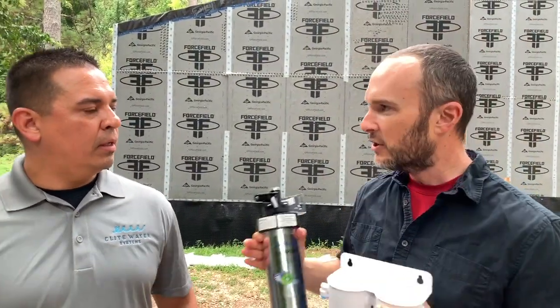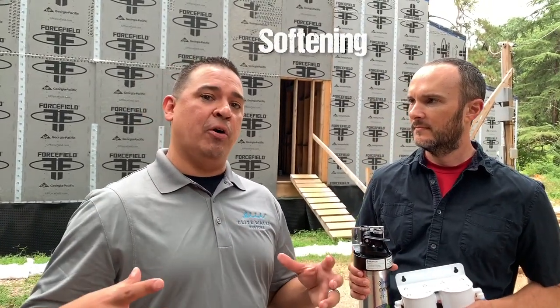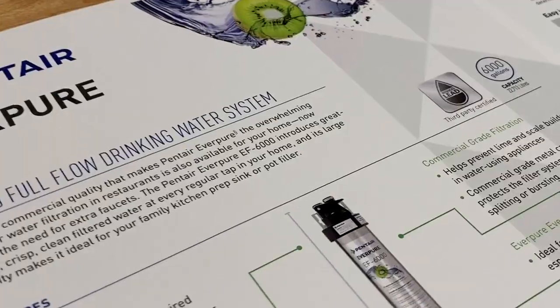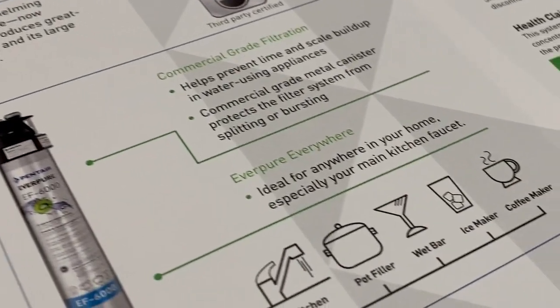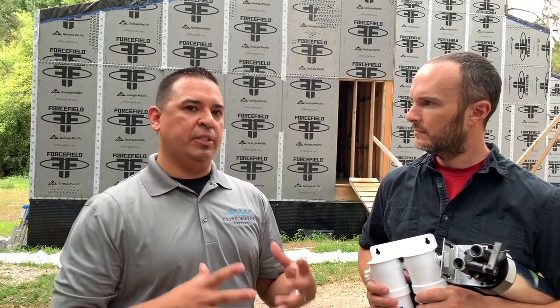The water is going to come into this house, and the first thing we're going to have to do to it is: we're going to remove the chemical disinfectant byproducts from the home at the point of entry. At that point, we're going to remove all the hardest minerals — calcium, magnesium, and iron — and whatever residual items that ion exchange will remove to render the general household water better, controlling even indoor air pollution. We specialize in the mechanical removal and filtration of the contaminants in the water to render it controllable, potable, usable, and pure, depending on what the use is.